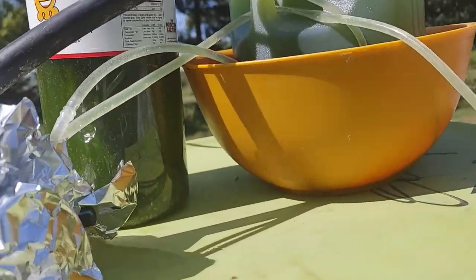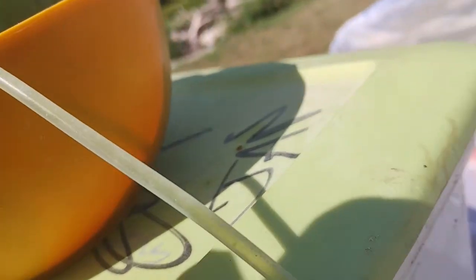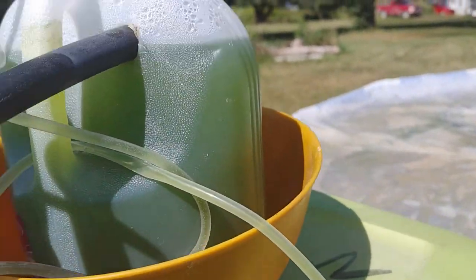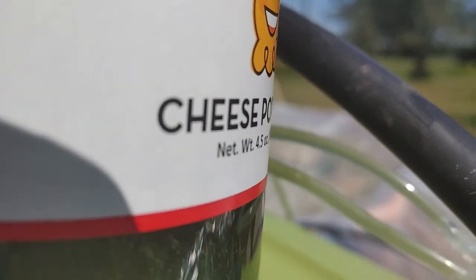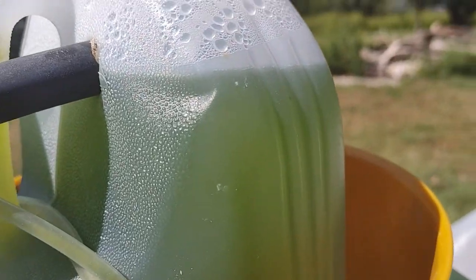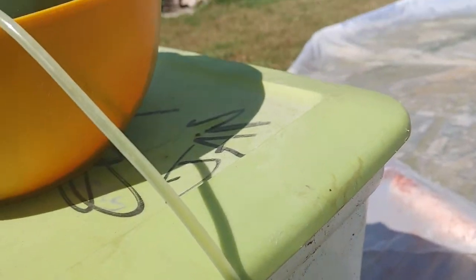The pump here is a peristaltic pump running at a very low rate. You might be able to see the fluid coming in from the photobioreactor — it comes in and drops into the very top, and then as it's being coagulated, the water floats down to the bottom where it is taken out through the siphon into a decanter overflow reservoir, then goes all the way down and comes back up into the photobioreactor some distance from where this tube collects the growth medium.